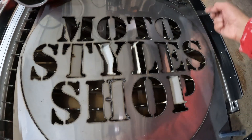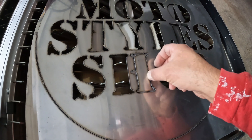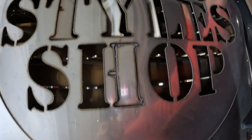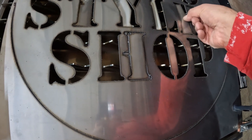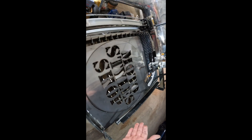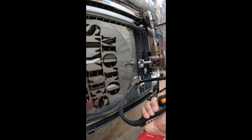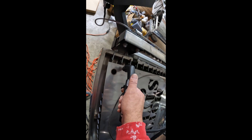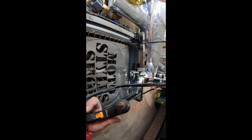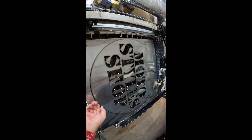Now the issue I have here — I'm just going to cut it real quick by hand. Let me see where else I have this issue. There's a spot right there, but other than that everything else ended up pretty nice. To release the plasma cutter from the machine you grab it — they have a stupid child-proof lock here — you move it outside and as soon as you put it on the metal it's already connected, so you just press it and it's ready to cut. This is what got plugged earlier; it's open now. I'm going to clean it and put it back.